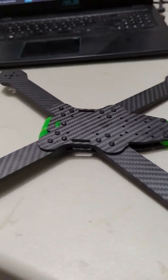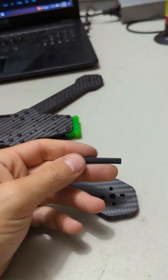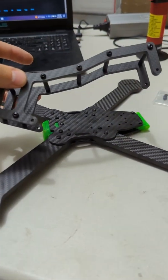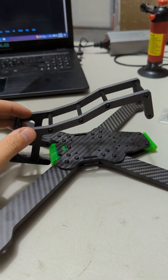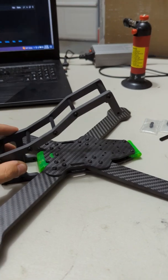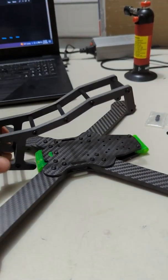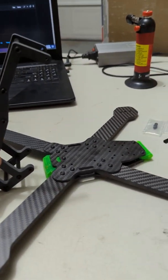The standoff can be pressed through the 3D print — we have them sized where they fit really well so it shouldn't be too difficult. The final note in this assembly video: the Kari X from the Street League store has a 35mm standoff canopy which is wider than the original model. That means you install the front link first and then hinge the canopy backwards into place. On the original you could leave the back and hinge the front up, but on this model you do the opposite — front gets installed first, rear hinges up when you need to access your stack.